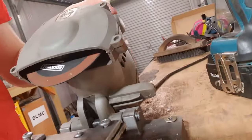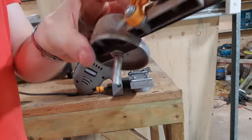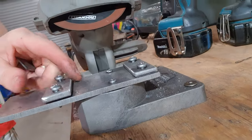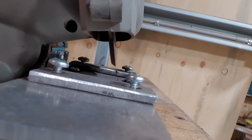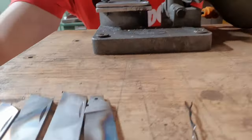The way that I've tried and seems to have worked is with this thing, which is a chainsaw sharpener with the chain part ripped off, and just a little aluminium fixture screwed to it, just out of 5mm plate with a couple of cheap metal screws. It looks really wild and dodgy. And for the disc itself — it's been reprofiled to whichever angle you want that will make a good nail nick.